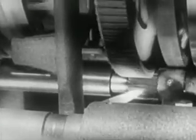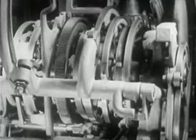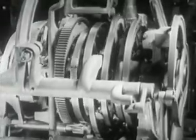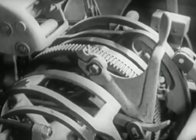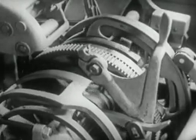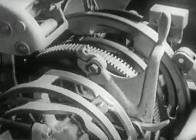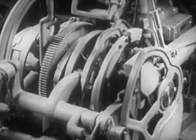At the opposite end, this shaft has a pinion that transmits the movement to the large driving gear on the camshaft. The cams are thus made to rotate. Every complete turn of the camshaft corresponds to the casting of a slug. Every eccentric cam has a specific function which it carries on during its cycle quite independently of the others.